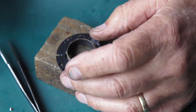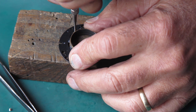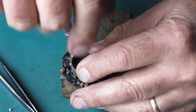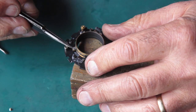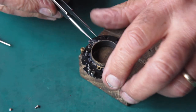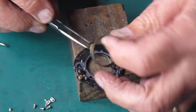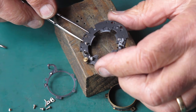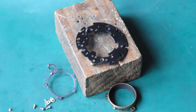Three screws here hold the lens tube in position. The lens tube in turn holds the blade actuating ring in position. There's the lens tube, the blade actuating ring, and the mechanism plate itself — stripped down. All of this just needs to be cleaned with naphtha and put back together, lubricating as I go.